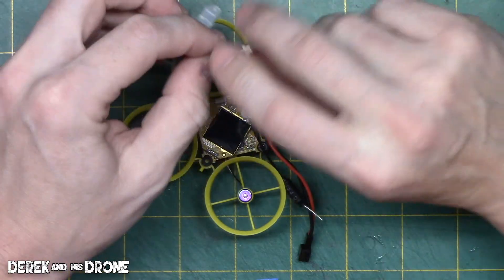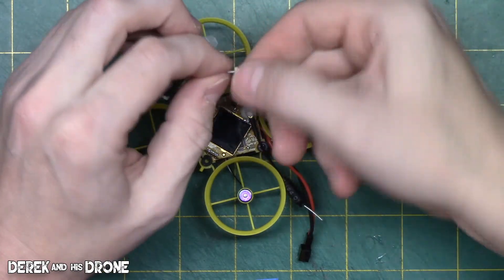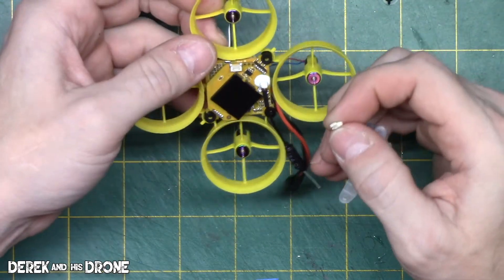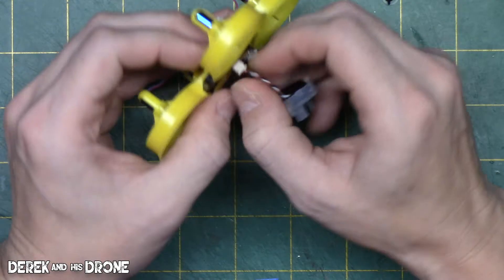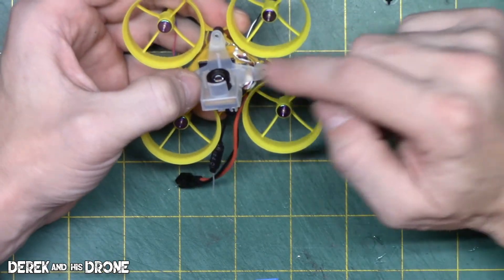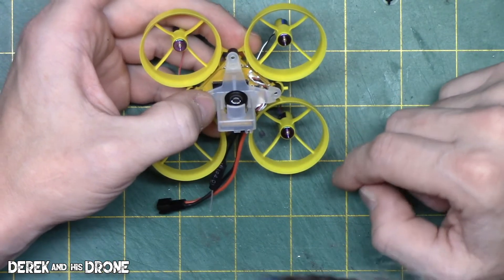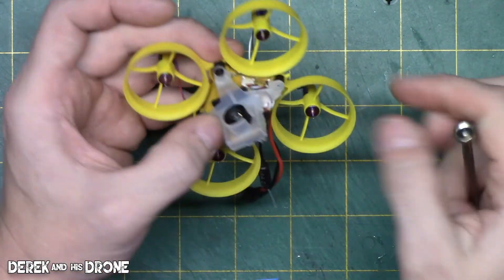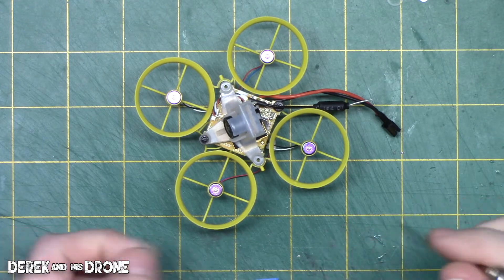Let's do the camera — twist the wires to keep them nice and neat looking. It looks good, so let's plug it into the connector. This connector is keyed so it should only plug in one direction — I wouldn't force it. There's plenty of room to have the camera wire go under the leg of the camera mount itself. Let's get some of the other screws in. Don't over-tighten and smush your grommets — if your grommets are smushed, the screw is too tight. That's it, that's simple.